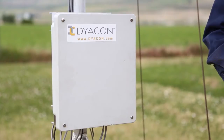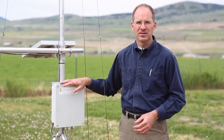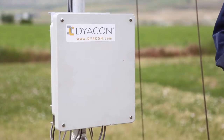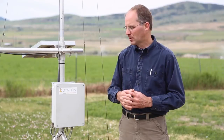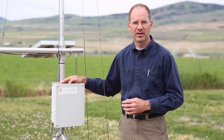The key to the whole weather station system is what we call the control module. The control module receives all of the inputs from the sensors as well as the solar panel. Inside, we have a single circuit board that integrates all of the inputs as well as a solar charge controller. It also includes a cell phone which is used for uploading data to Weather Underground as well as transmitting text message weather reports. The control module includes lightning detection as well as flash memory for data logging capability.